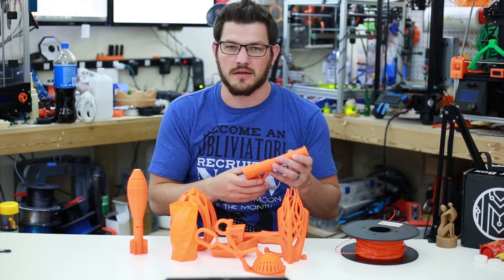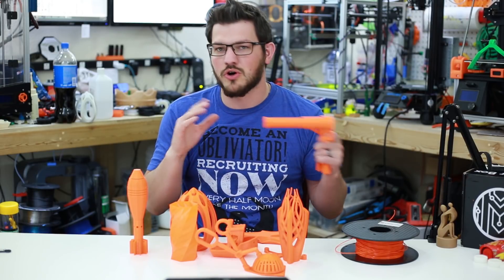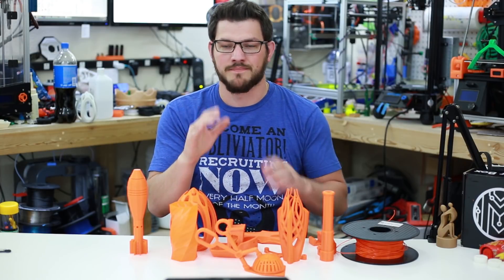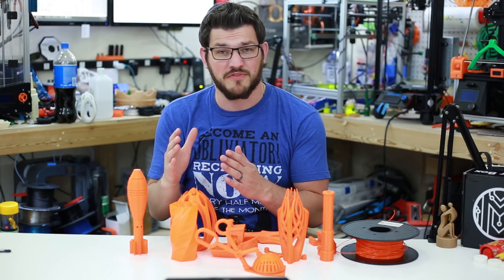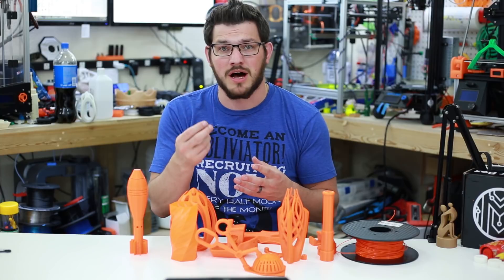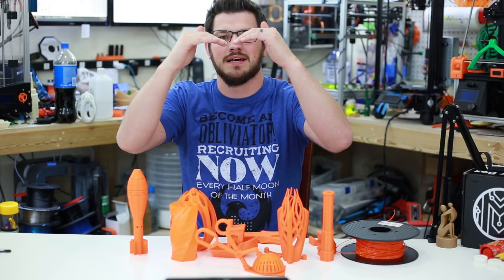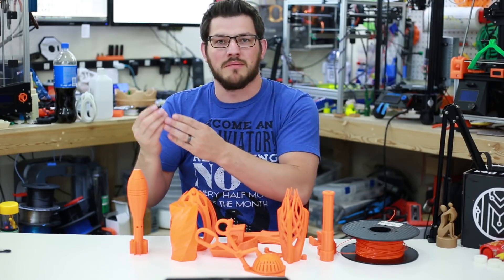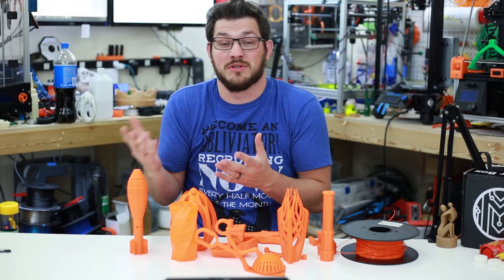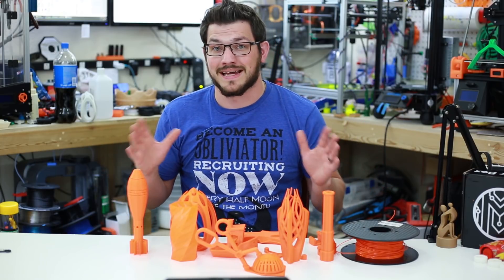The high-temp nozzle is not necessary for PETG, but I just like that setup. The prints look so nice and the filament behaved very well — very, very little stringing. A big problem with PETG that most people face is that because you're printing hot and slow, you end up with blobs every now and then. They'll form on the nozzle and eventually just appear randomly on your print. I've had that with every PETG I've ever used, and it's very common throughout the community.